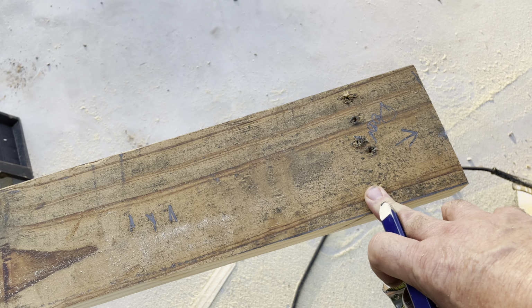I decided to put the door here, about 3 feet in from the end. That way, if I ever want to put a workbench along this wall, I can, and it won't really be in the way. So this is a regular stud here. I just put a cripple next to it, and then it's a 36 inch door. So I always go 2.5 inches over door size. So that's 38.5 inches clear, which brings me to here. And then there's the cripple and the stud there.